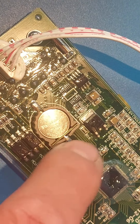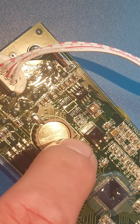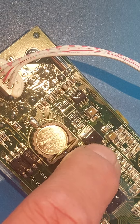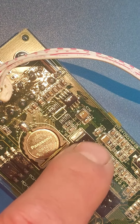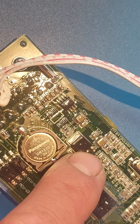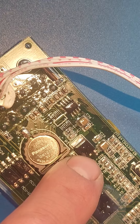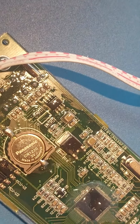It's not an easy task to replace that transistor because there's a plastic case of the battery here, so we cannot preheat it too much or we'll melt the battery case. Also, all the small capacitors beside it can fall off. So it's really not for DIYers — unless you have a really good soldering station, in which case you might manage, but be careful.